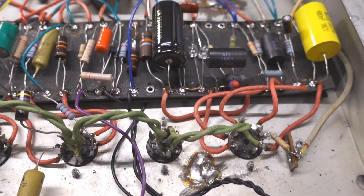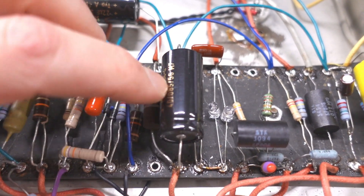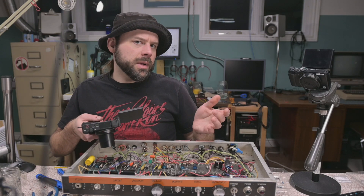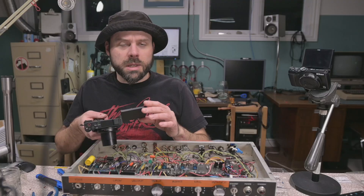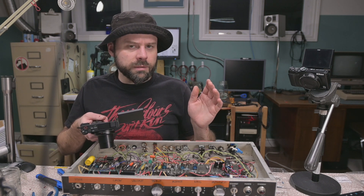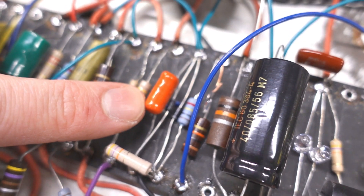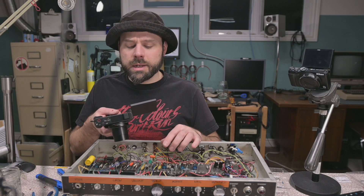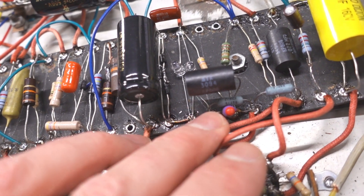Let me give you the tour. We've got a little bit of floaty action here but that should be okay. Those are not the kind of LEDs you'd normally use, but I couldn't find the right ones in stock — those are on order, they're red super bright ones. The important aspect is that they have the same cutoff voltage. This is the diode clipping section for the rhythm channel — that's supposed to be a 0.0022, but I underestimated my stock and ended up using a 0.0027. Hopefully that's okay — it's only on the rhythm section.